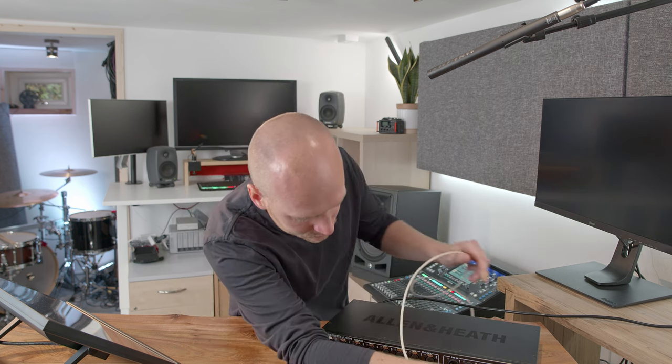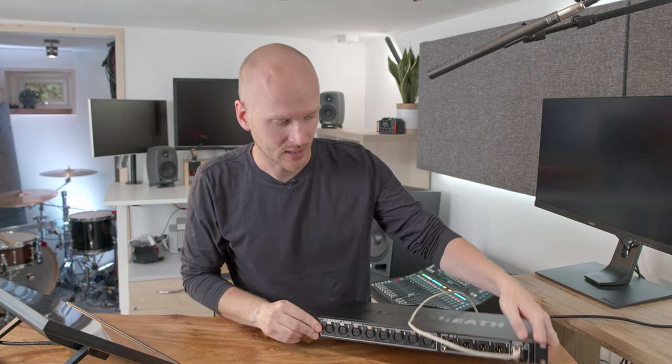Some will have Cat5, some will have Cat6, some will need shielded, some won't — so just check exactly what type of cable you need for your system. I can plug this cable into my stage box here and we'll see a light indicating that it is connected. At this point some stage box models will have LED lights on the front indicating whether or not they've got phantom power on those channels. As you turn phantom power on your mixing desk, it will light up on the stage box to show that it's active for those particular channels. From that point, we're ready to start plugging things in.